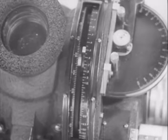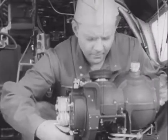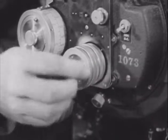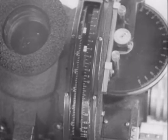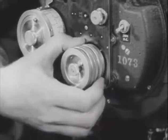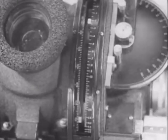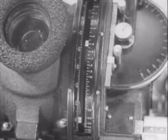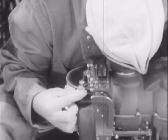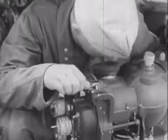Telescope search knob moves the sighting angle index, so that's okay. Telescope motor clutch in. Displacement knob okay. And rate knob's moving the rate index. Don't leave it at zero — leave it at .5. Turn sight for maximum drift. Trail arm moves freely. Telescope tilting all right? And your cross-trail mechanism's okay.